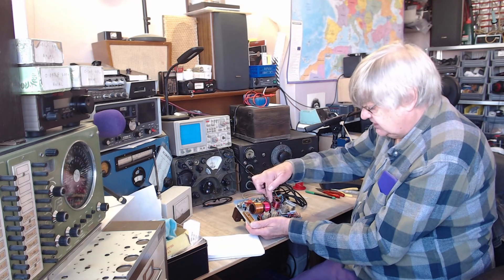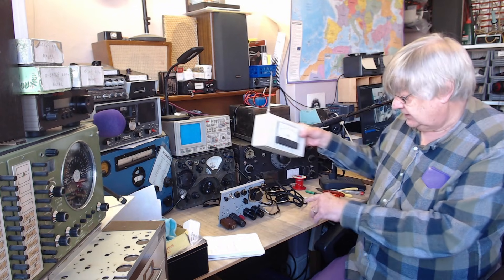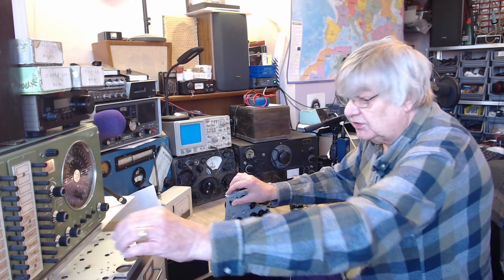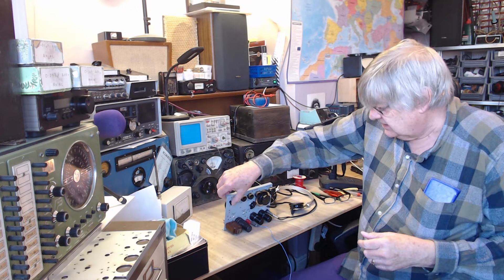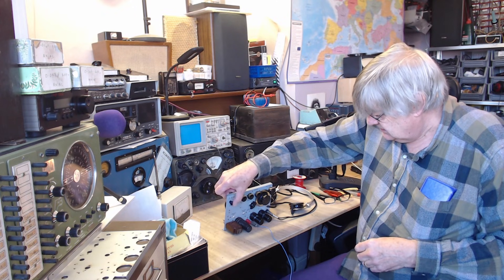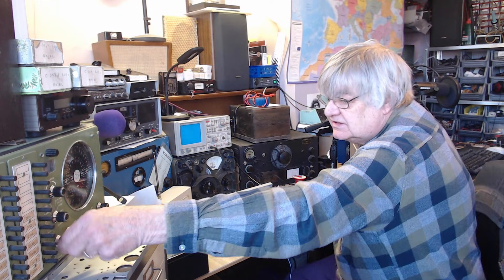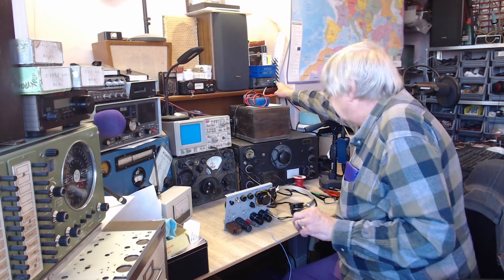There's a tuning lamp I haven't wired up yet - I've got to put one turn on each end of the coil for each lamp. I've got the transmitter into a dummy load and my RF sniffer, so I just tune for maximum on here and it works very well. Now I'll give you a demo of the transmitter working. Let's turn the receiver on here - it's a bit difficult to send Morse like this. There we are - switch to transmit, switch to receive. No one's replying but it's on a dummy load.